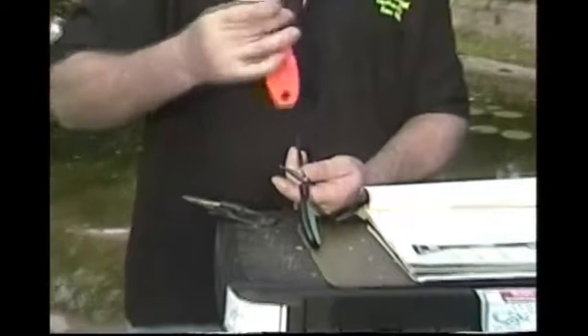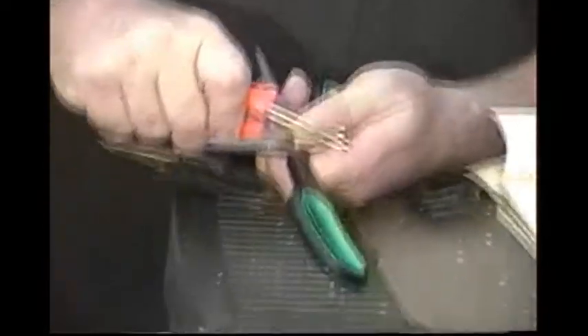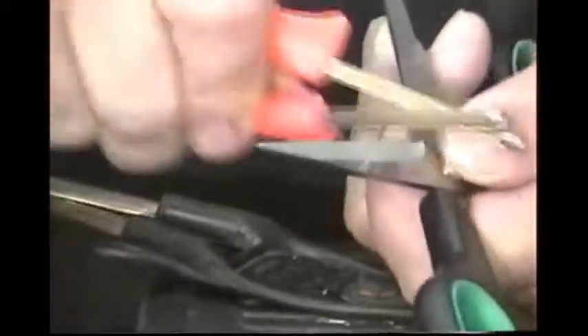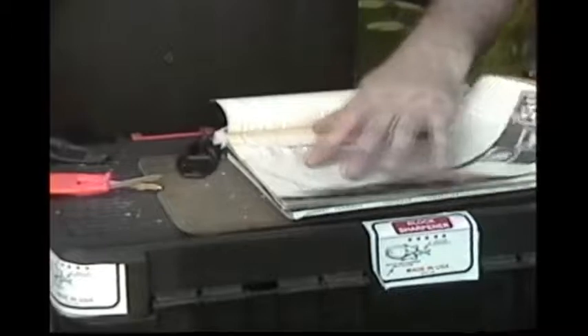It's also known for doing scissors, garden tools, and a lot of different things. It's a hard pin — it's round, it's flexible, and it'll grab any angle you've got. Use it on the side of your scissors and follow the blade. You strike them 10 to 15 times — that flattens it out. Turn them on the side, you get a burr on this side, hold that flat, sweep that corner, and you'll get them as sharp as any knife.